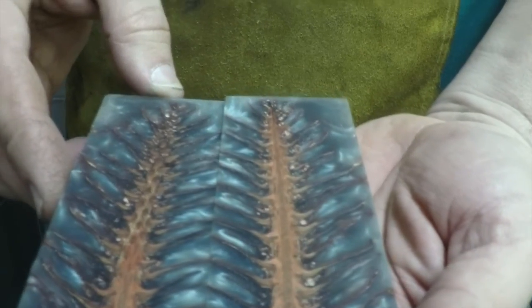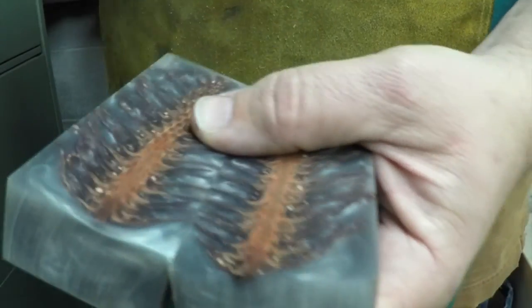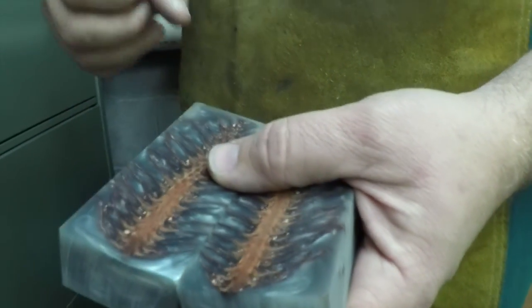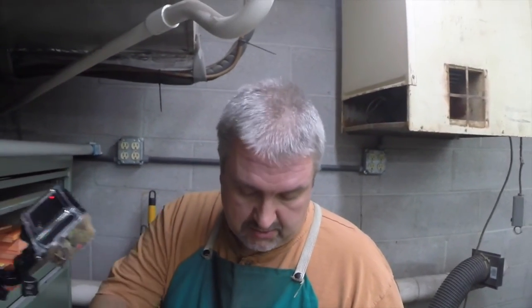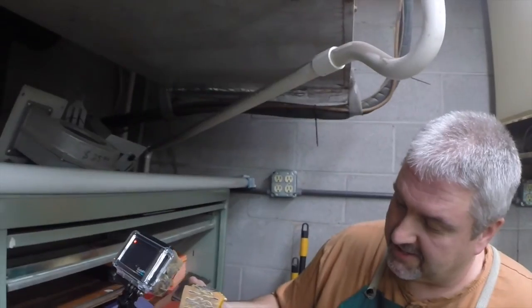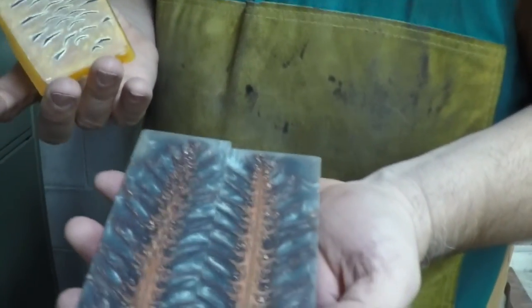Wow. This is a pine cone. Really? Yep. Just a pine cone that fell off of a tree, pick it up, suspend it in a cup, pour this acrylic resin around it. First, the pine cone's been stabilized with a clear epoxy. It's been pumped and vacuumed, put in a vacuum and pulled to 29-30 pounds of pressure. And it pulls the epoxy all into the pine cone. So after it's been stabilized, then you suspend it in a cup, normally a little Dixie cup, and the little shape of a Dixie cup there. This would be the outer edges of the pine cone. I got you. Your center cut is your most desirable.